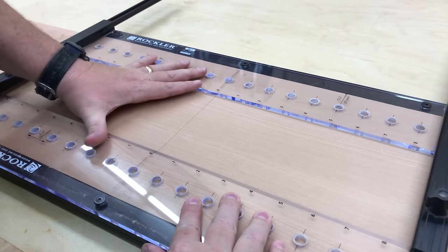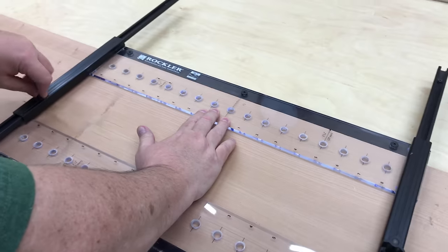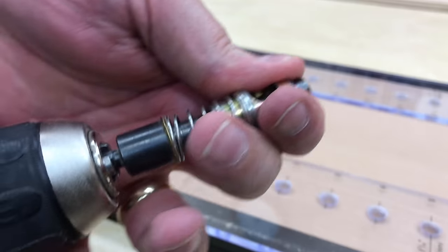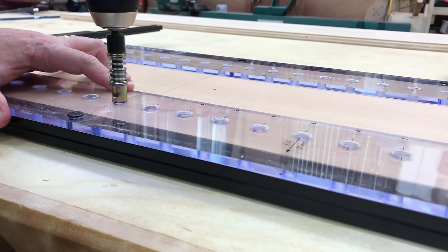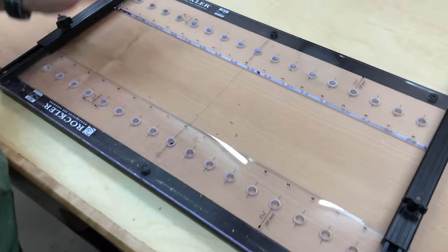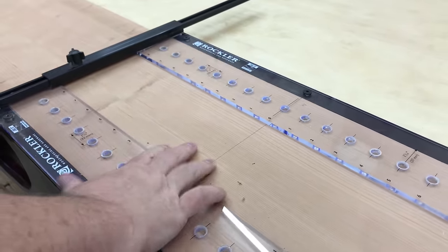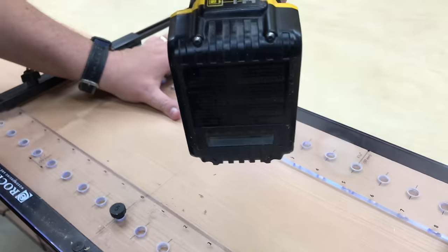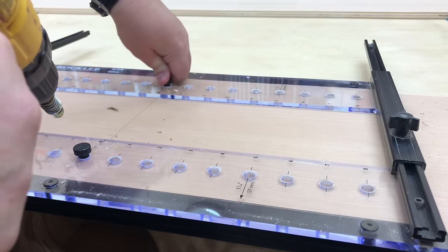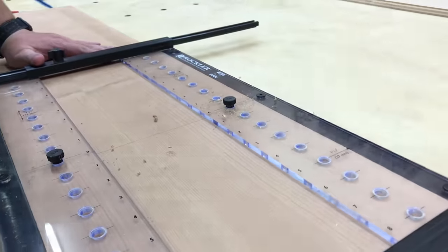This is a shelf pin drilling layout jig — I bought this one from Rockler, also available on Amazon, and I'll put a link in the description. It allows you to have perfectly evenly spaced pins. The drill bit that comes with the kit has a little spring-loaded collar that puts the pinholes at exactly the right depth. The best way to use it: once you get the very first pinhole in, put a locking pin in so the jig won't slide left or right as you drill the remainder. That keeps alignment perfect as you go down the row. Once you reach the end of the jig, take the locking pins out, slide the jig down to the last hole, line it up, put the locking pin back in, and keep going so the spacing stays the same.